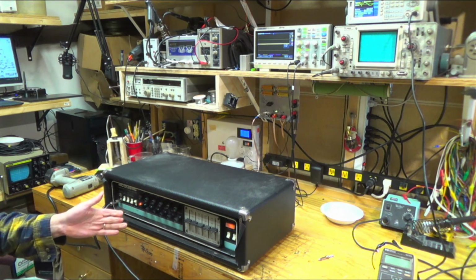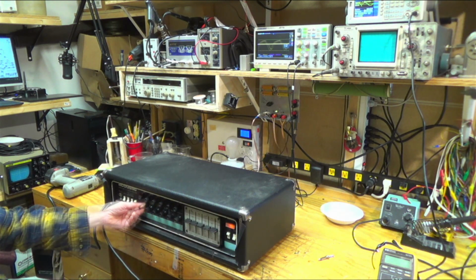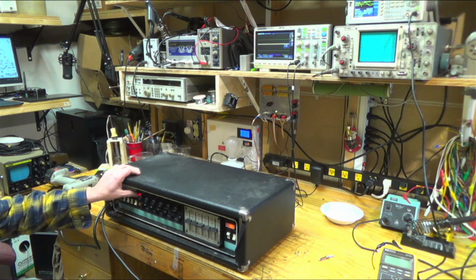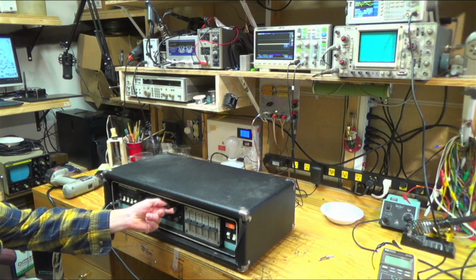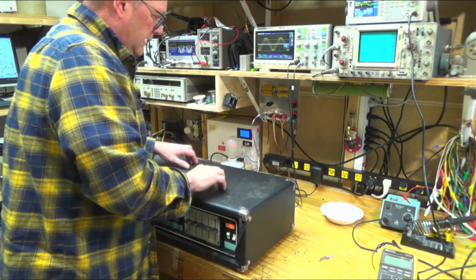Most of the problems I had with it before were with the main amp, and well, I had problems with both the main amp and the preamp. The preamp had a bunch of FETs that were out, and the FETs were to switch on different features, and a lot of those were bad, and I replaced those, and that got stuff like the distortion working, which was messed up.